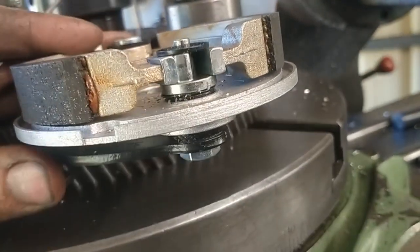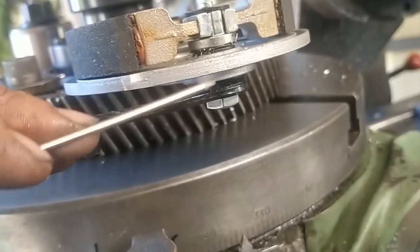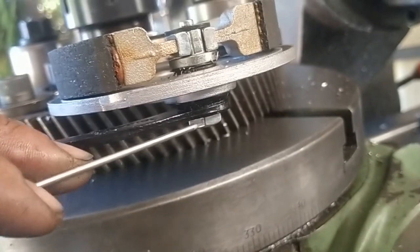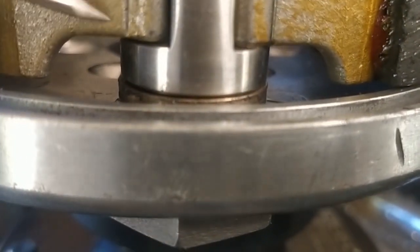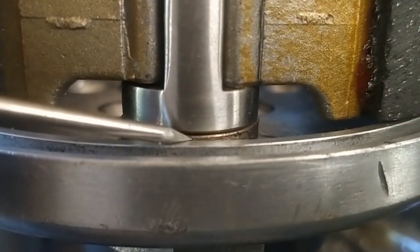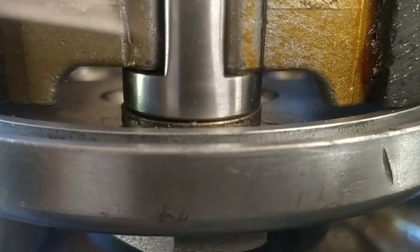It works like so. It's got an arm, so that arm needs to bite onto the shaft, and I think it's a square thing. There's this little spring washer there and a plastic bearing. I've gone with an aluminium bronze bearing there. I've made the mistake of putting it slightly higher than this surface. I will attend to that later.